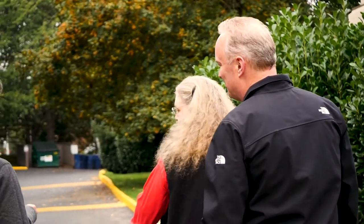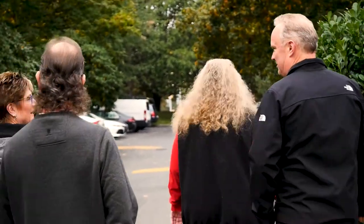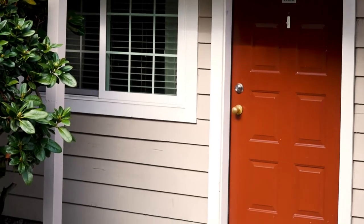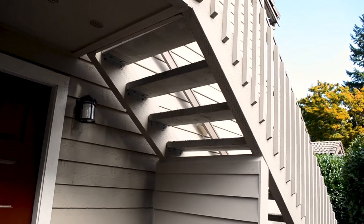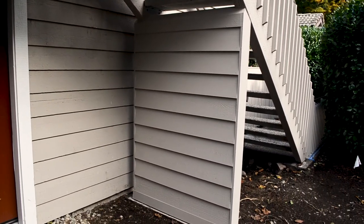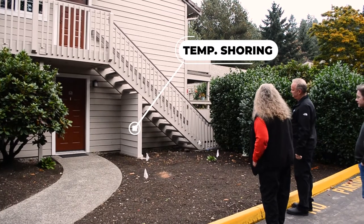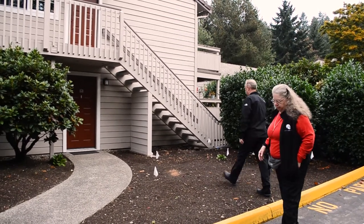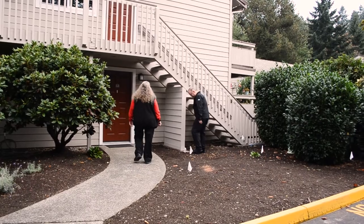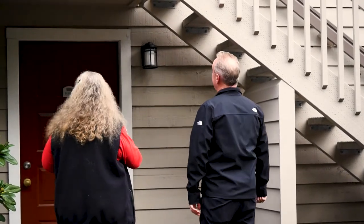Hi, I'm Jens. — I'm Norma. — Nice to meet you, Norma. So here's a project we're working on right now. This staircase was trying its best to detach from the landing — bad thing. We've replaced the stairs, and while we were working on it we put in this temporary shoring, which we decided to leave because it can't hurt. We made it pretty and put some siding on it — it's standing on some concrete, so this is all brand new. When we do one of these, we replace all the concrete treads so we don't have a mismatch.